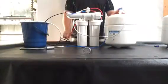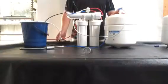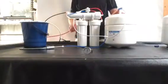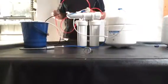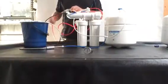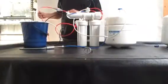The first thing I want to show you is the water inlet — it's this red tube. This is the water coming in from underneath your sink, so this will be hooked up to the cold water connection under your sink. You should have something like the pressure limiting valve, which stops the system getting any pressure spikes that may crack the housings.